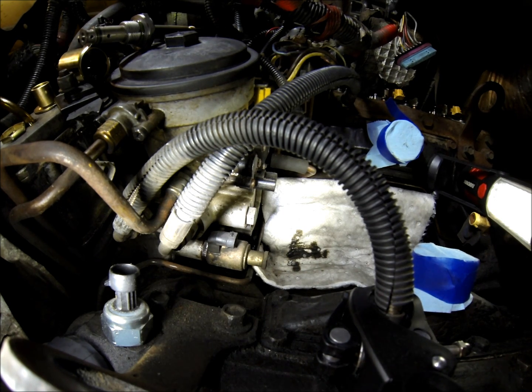In this case, we have a few items removed just to make it a little easier to get in there and see it, but it's not that hard at all anyway. One thing I have done is drained the high pressure oil pump reservoir to ensure that I don't have a ton of oil pouring out. I did put a rag in there to capture it because some will come out usually anyway.